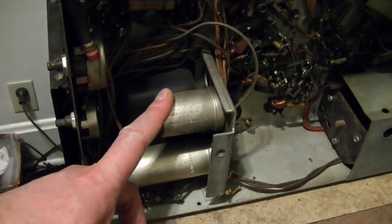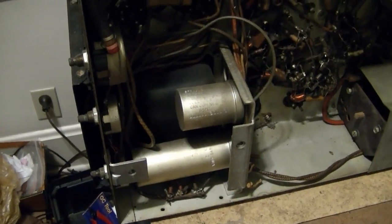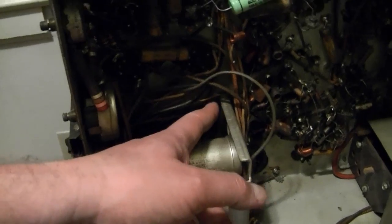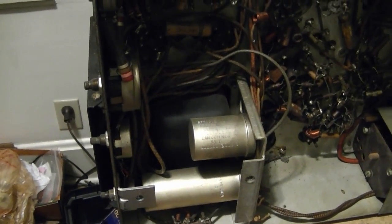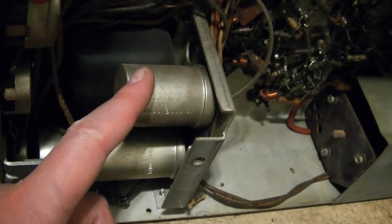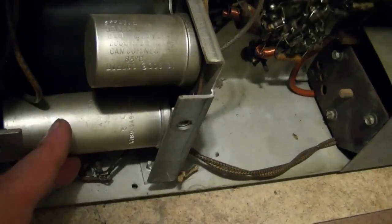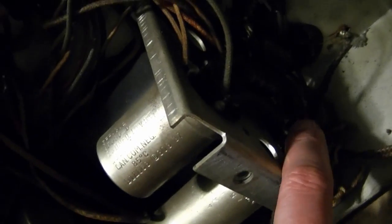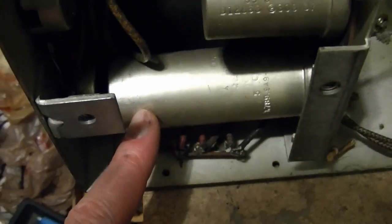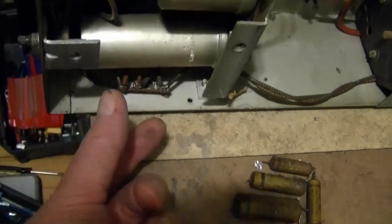I also want to restuff a lot of cans, which are going to be a little tricky to get out. But I got some advice online and they assure me that it is possible to get this out without having to unmount this bracket, which is pretty tricky because the bolts go up through the power transformer and they're not easy to get at. I just want to make sure I'm very careful not to break these bases, because these cans are not connected to this ground — they're floating — and they have insulating wafers that are somewhat fragile. So I'm going to carefully unsolder the connections going to the cap, untwist the twist lock tabs, and then hopefully there's enough clearance to pop it loose from the base, and then angle it and slide it out.